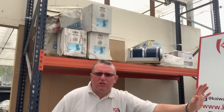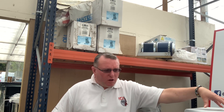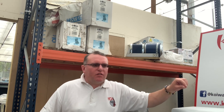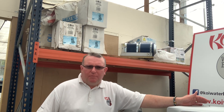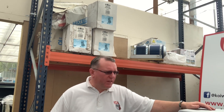The only caveat with that is, obviously, if you're looking to keep an outdoor pond at 15 degrees in the middle of winter, this won't do it. Because when the air temperature drops, you'll eventually get to the point where it's taking in 600 watts to give you back 600 watts, so it won't actually heat. So it's more of a seasonal heating device for an indoor smaller pond, up to around 800 gallons. Hence why we're looking at the four or five kilowatt models, which should each have a place on the market.